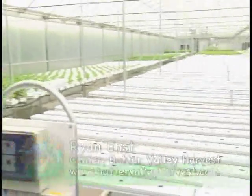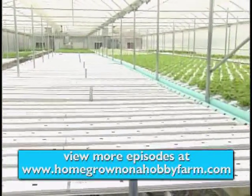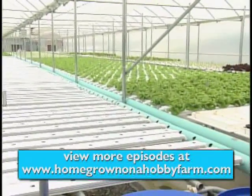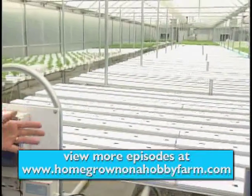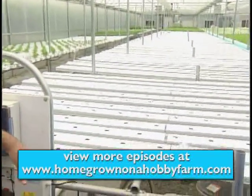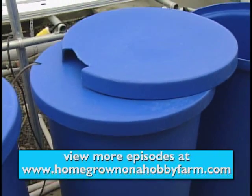Rangan, tell me a little bit about actually feeding the plants with the water. Well, I talked about the recipe here that's mixed in this 1,000 gallon tank, and the pump pumps it all the way uphill. The greenhouse is situated uphill about 1.5% grade. It's pumped all the way up, and then returns by gravity, and whatever's not used by the plant comes back to the tank, and it's remixed accordingly to get the proper pH and nutrients.